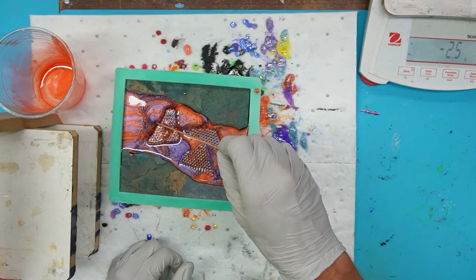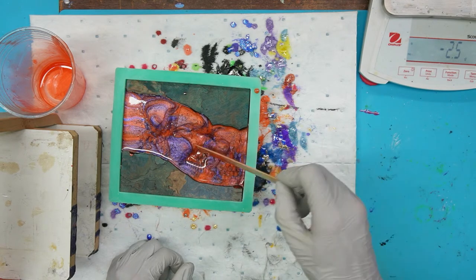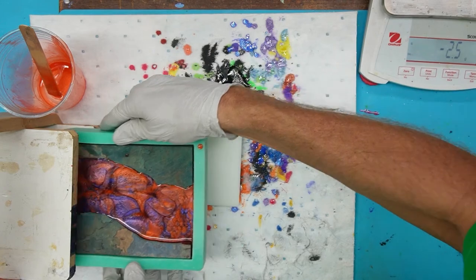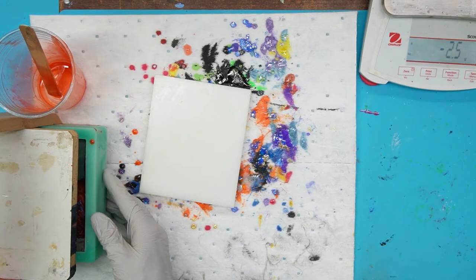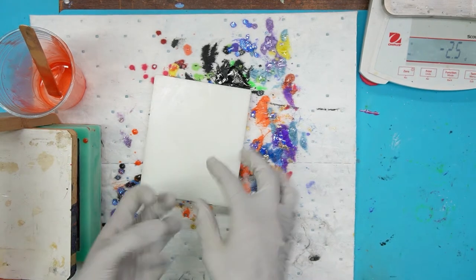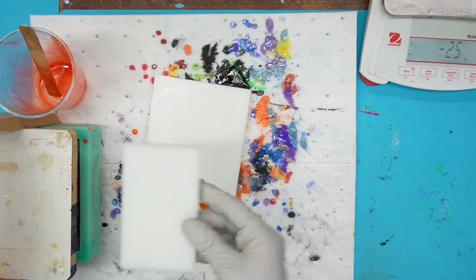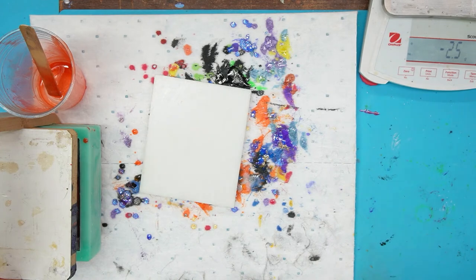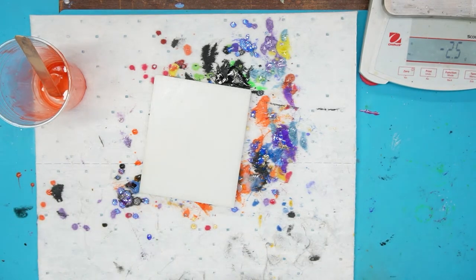Sometimes you need to kind of help it out a little bit. You don't want to really force it. You want to make sure that the resin is pushing through those cells. Okay. I would say one maybe drawback to the silicone molds is it can flex. And so I'm going to put this little HDPE piece on top of the burls, just to try and help it stay down. I don't really think it's gonna go anywhere, but. All right. Into the pressure pot you go.